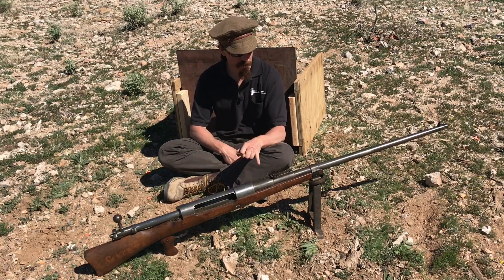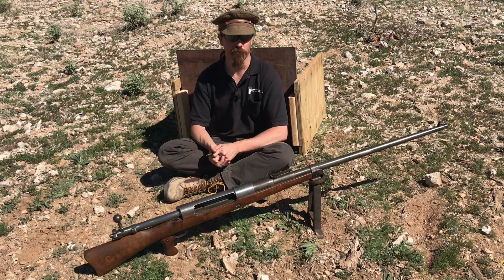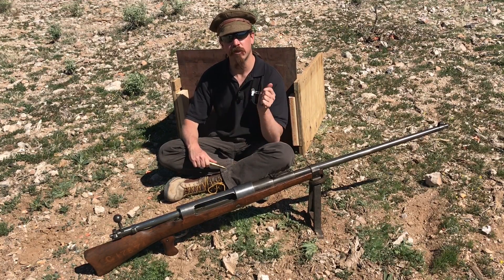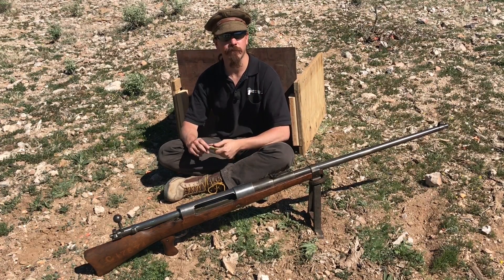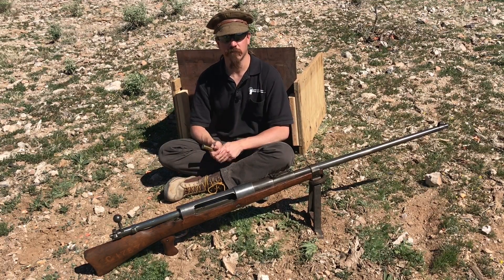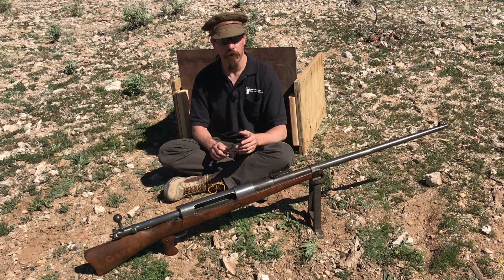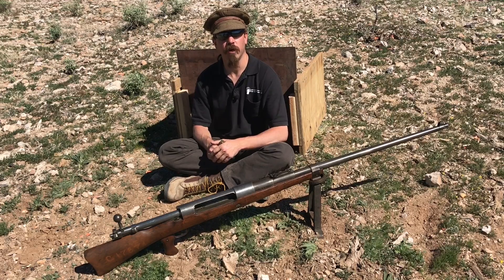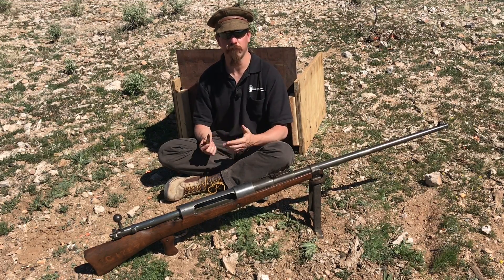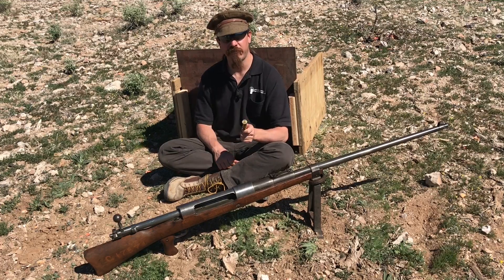At any rate, this was the German answer to the British tank — the question is, was it effective? The Mark IV British tank was the most common one in use; the British made about 1,200 of them. The Mark IV had three different thicknesses of armour: 6mm armour covering the side of the tracks, 8mm armour over some areas of the engine, and 12mm armour over the main crew compartment. Now 6mm and 8mm armour is suitable to stop rifle bullets; 12mm is excellent for stopping rifle bullets. The question is, would it stop one of these? I did some research and found that the British spec for tank armour at this point was 440 to 480 Brinell through-hardened — hardened all the way through the metal, which is what makes good proper armour plate. Right in the middle of that range is 450, which is what we have here.